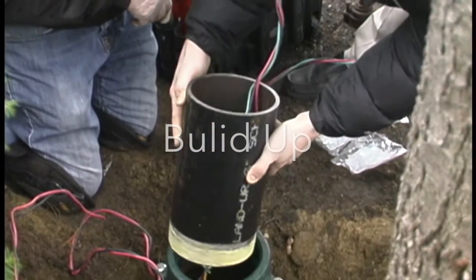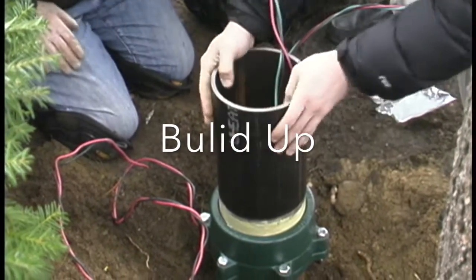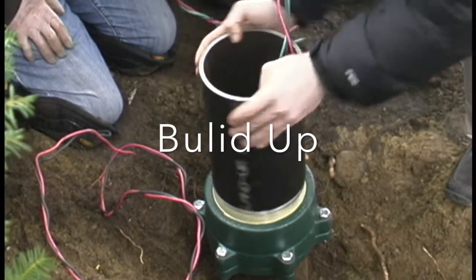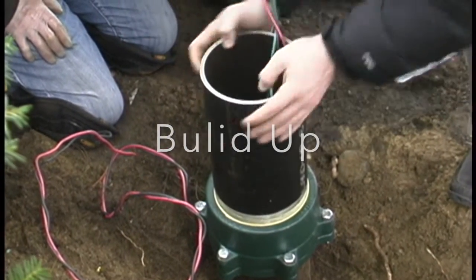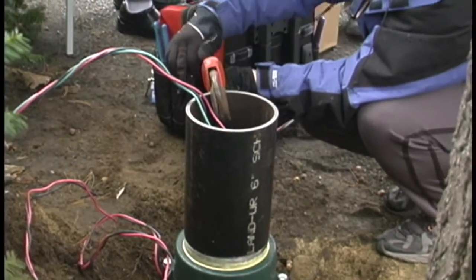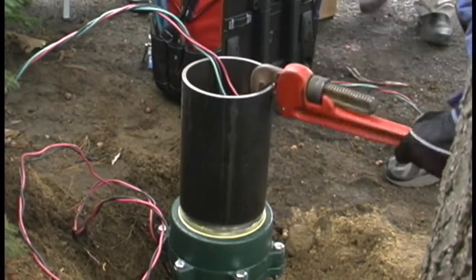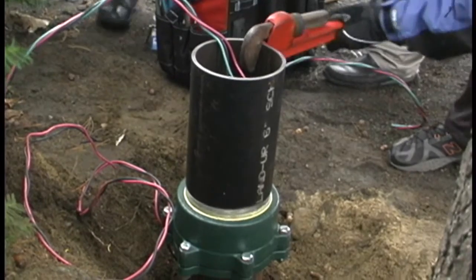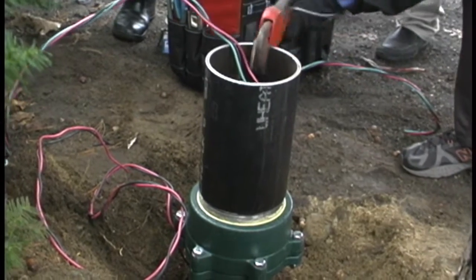What we do is we thread the extension with the wire coming up from the well, which is the connector to the pump obviously. And then we screw that in to the connector. You can see the sealant material just working itself right in. We want a really nice tight fit in there. Once we hand put it in, we'll take a pipe wrench, grab a hold of it, and we'll finish it right off. Tighten it right in until it completely seizes in. Now we know that connection right there is watertight — that's what's quite important.